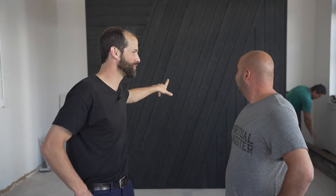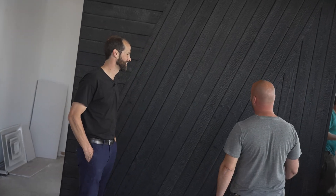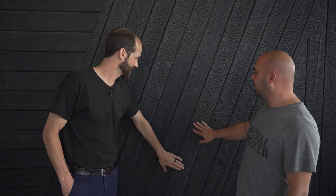I can't help but notice what's behind us here — can you tell us more about this? So this is called in the American market Shou Sugi Ban. The real name is actually Yaki Sugi. It's a cedar siding process where you burn and char it — there are obviously different stages for the charring. Then you seal it so you don't get soot on your hand. You can clean it up with water after, then seal it with a flooring sealer. There are numerous ways to do it depending on whether it's indoor or outdoor. Each one of these boards is roughly $120. They made those in Texas, but you can do it at home — it's not that hard.